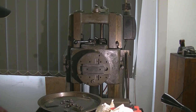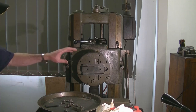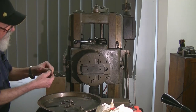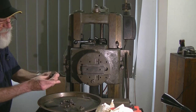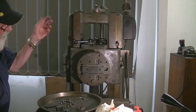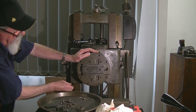But mine's slipping all the time now. Interestingly, as I undid the bolts for the facing head, the feed suddenly started to work — so there's a bit of resistance inside this head causing the problem. There are two clamping plates, one on either side, that fit in here with a cap screw through the middle. Securing the slide gives you a little more rigidity so it doesn't play around on you. This is the lock that slides in to lock the slide in the central position.